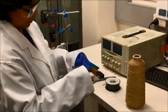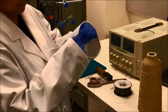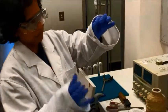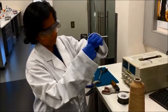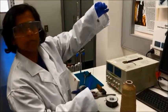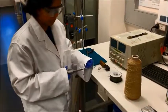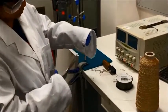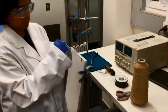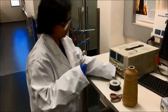The details of where we purchase the yarn are given at the end of the video. We take equal lengths of both the fishing line and the silver coated nylon yarn and fix them to paper clips at both ends for mechanical connection while we do the twisting and coiling. The threads are attached to the paper clip just by tying them.